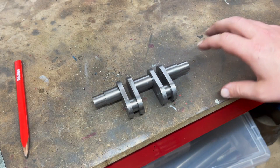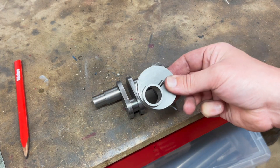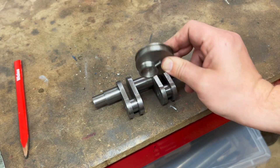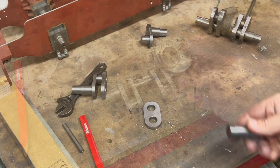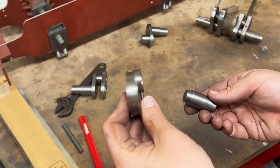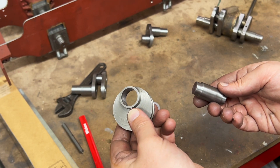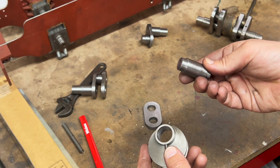Here's all the pieces required for the crank axle. I do also have the eccentric sheave for the axle pump, which was the very first thing I machined for the Maid of Kent in the very first episode. The problem I have of course is that when I machined this eccentric sheave I didn't have the correct size reamer, so I just drilled it undersized. So this doesn't actually fit on the central stub axle.